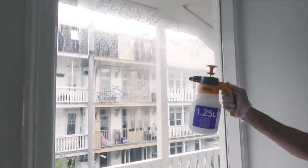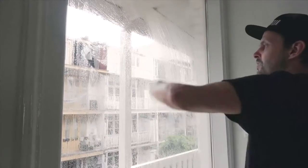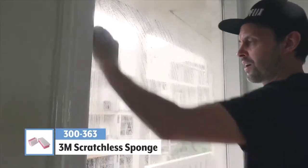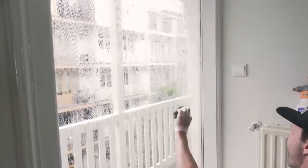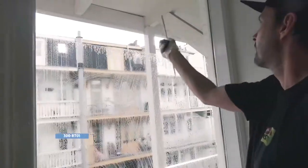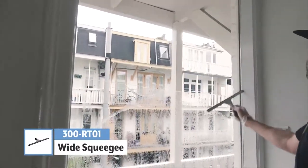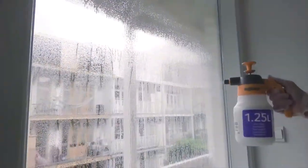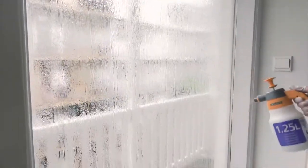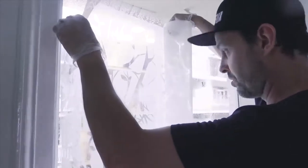Now it's time to spray the window. It's very important to remove tiny specks that can build up on the glass. Using a scratchless sponge, work from top to bottom. The solution being used is simply soap and water. Then, using a wide squeegee, work from the top to the bottom and remove all the soapy residue. Once removed, spray the window again with a mixture of water and film-on, which is the slip solution for the window film. Spray from top to bottom, nice and even.